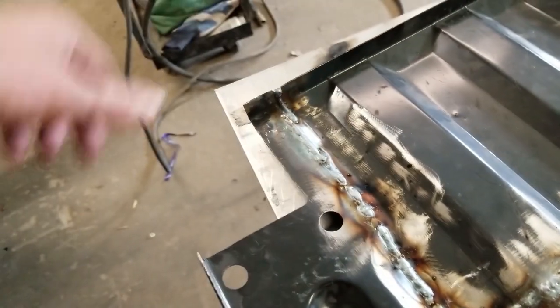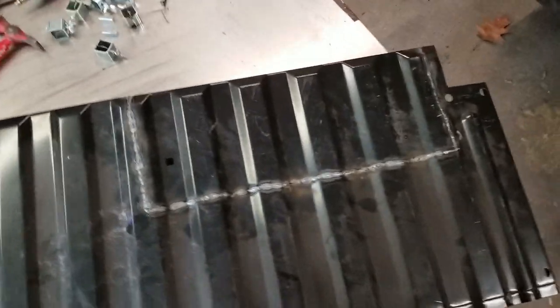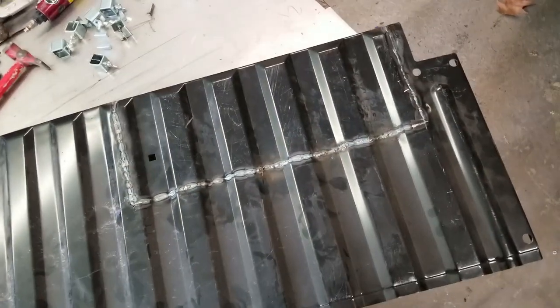There it is — my final results. If there's anything I know about welding, you definitely have to make sure everything is clamped down so it doesn't move, and you need those clamps in there to make sure the gaps stay true. One thing I did mess up: when I had the clamp down at the end I didn't recheck it after I put a couple more clamps on, and it made the piece just a little bit bowed. But it's gonna hold pretty well, those welds look like they got enough penetration. I am going to have to do a little body filler on top, but that's a whole lot better than what he was working with. You know the deal — if you liked the video, like the video, subscribe for more content like this. Thanks for watching, Car Craftsman out.